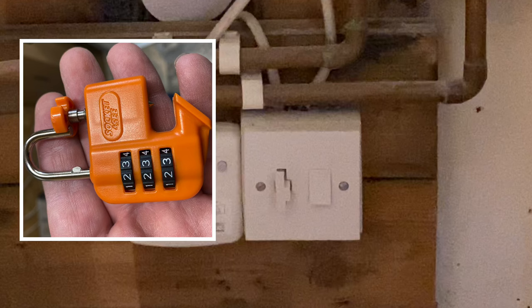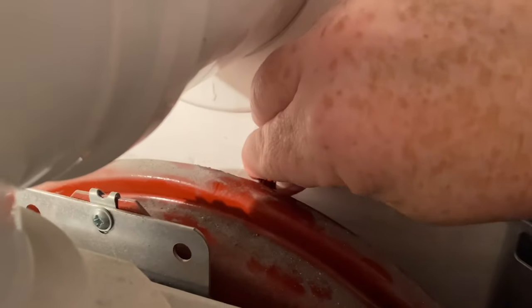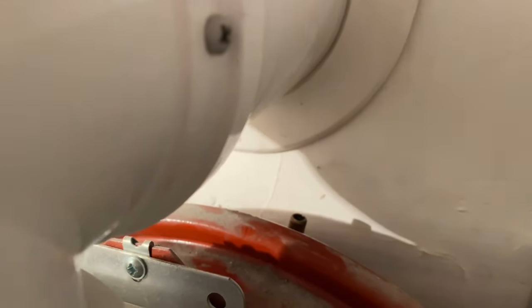First of all we're going to do all our safety checks, then we're going to isolate the boiler and remove the fuse. You can also get a lock for the fuse if you're going to be going outside or away from the boiler. On this Worcester Bosch boiler the expansion vessel is on the back, so when you're doing a service on one of these boilers you should be pumping the expansion vessel up. If it had been pumped up it may not have failed — it's probably not been serviced for quite a long time.